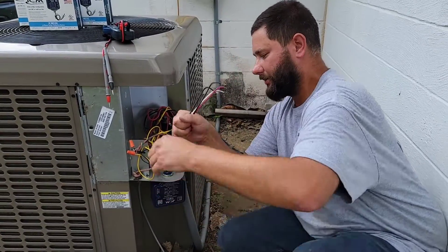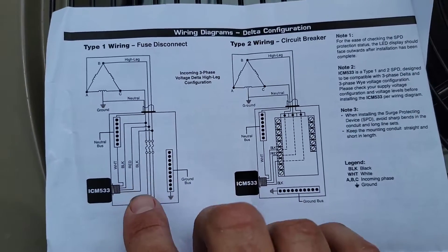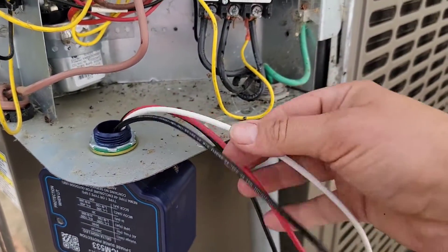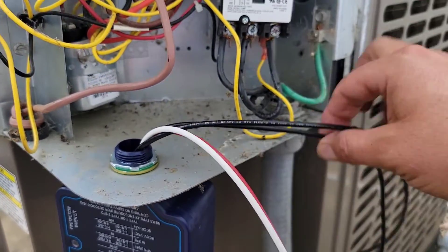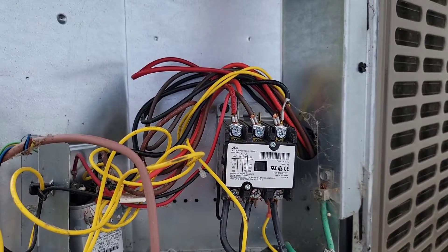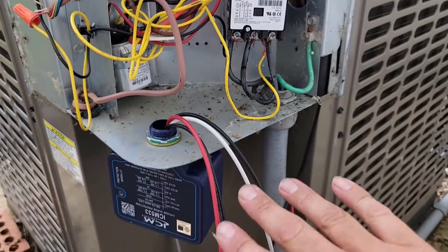Once it's nice and tight, look at the diagram — it's pretty evident how this wires up. Pause the video to see how it's installed at the fuse disconnect or circuit breaker. In simple terms: we've got four wires. The white wire is installed at the ground. The two black wires are installed on the two phases that are not the high leg. The red wire is installed where the high leg was — in this case, the phase on the very left.